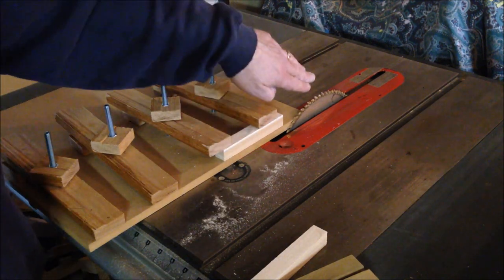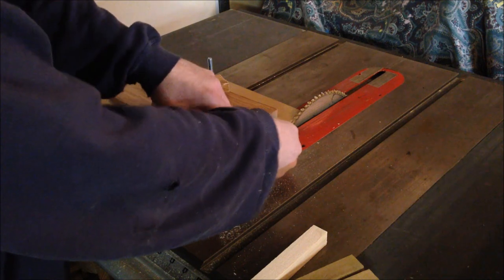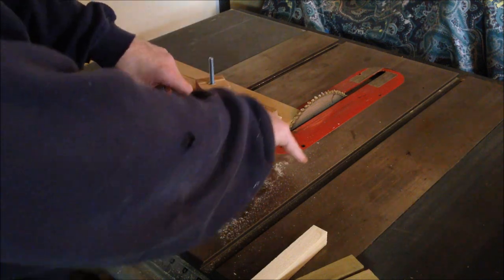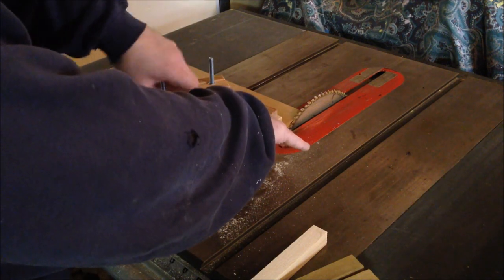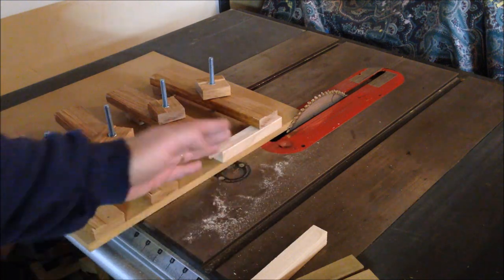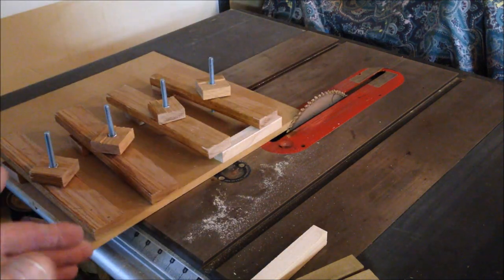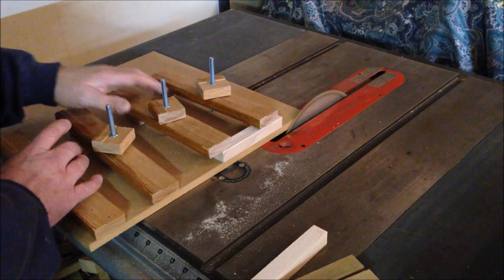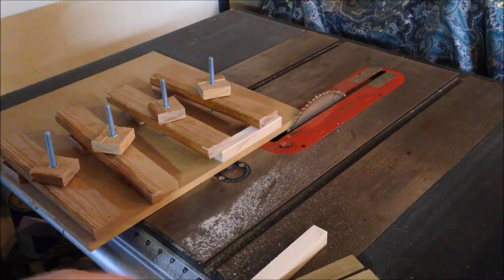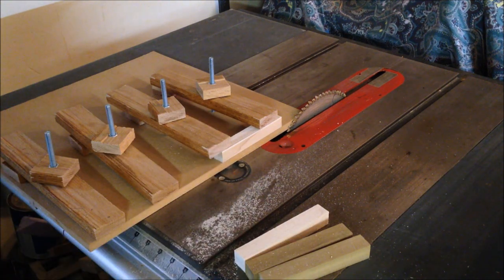I've made one side perfectly flat with the blade. Now I'll loosen the jig, take the flattened side and place it face-down on the sled, and tighten it down. Once I joint this side, I'll be able to bring the table saw fence up and run the other two sides through to get a perfectly sized piece that's flat and jointed on all four sides. All that's left is to run the other three pieces through, then square them all off to have four perfectly square pieces.